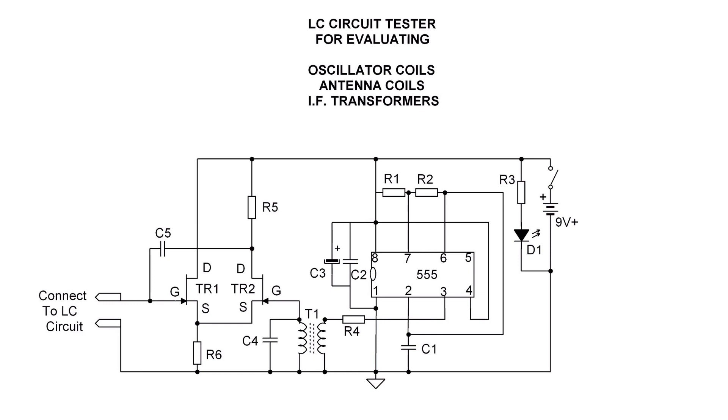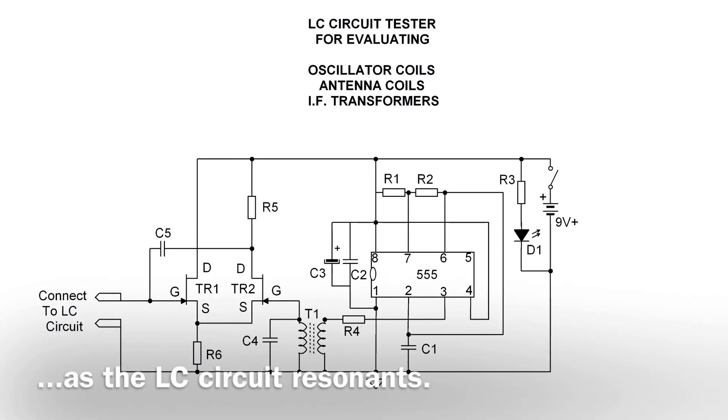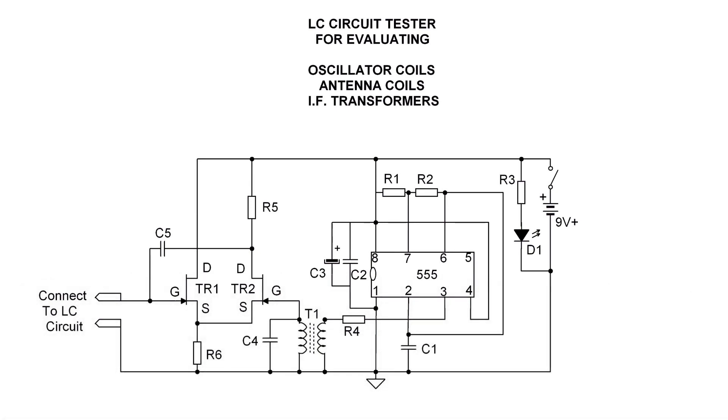You'll see the modifications I made by adding a 555 timer configured to create a modulated tone around one kilohertz — it's more of a sawtooth. After it goes through R4, the one meg resistor, back over to T1, that signal is applied to the gate of TR2. That's really the big difference in the design. I'm using a separate receiver to listen to the tone in near proximity to the tank circuit or LC circuit being tested. Other than that, it's very similar to the original design.